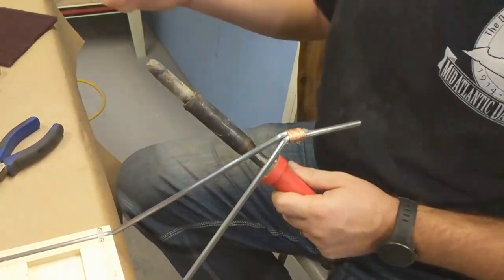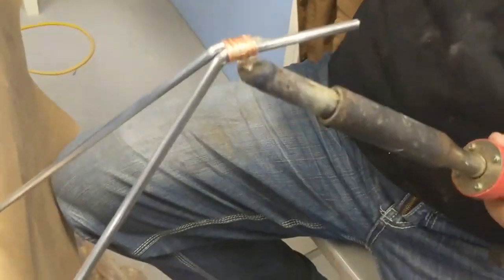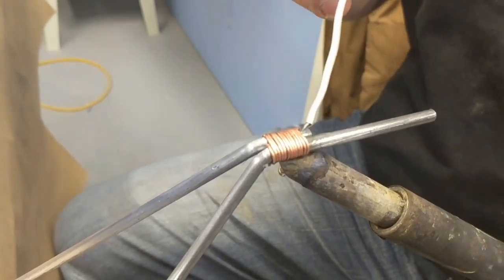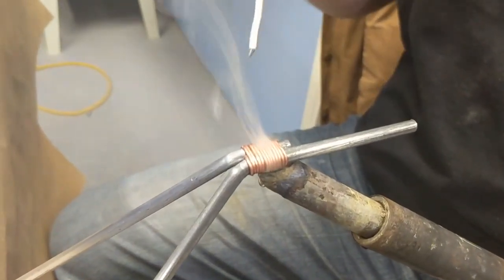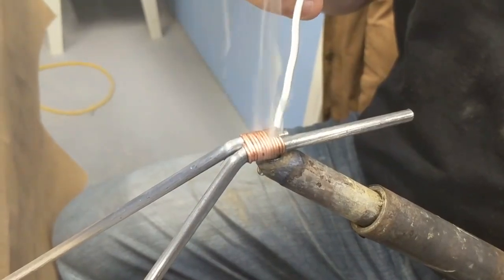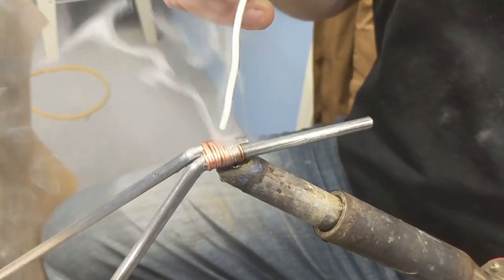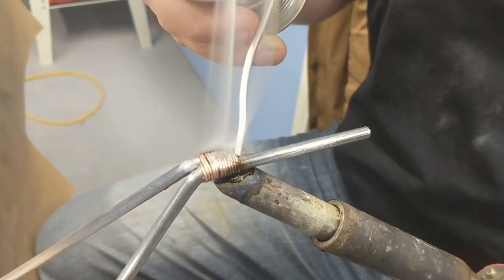Then take your soldering iron, put a little solder on there, get her started, and then just push up to it. You'll see the flux starts to melt. Let it sit on there for a little bit. You want to touch on the top — you don't want to use the tip to melt it. You want to wait until the wire gets warm enough to melt it itself. Make sure you do this in a good ventilated area because there will be a lot of fumes. Now you can see it's starting to melt. Now you understand why you need to have such a big iron. It's starting to soak in there, so I'll slowly work it in. It's going to drip on you, so make sure you don't have your leg underneath it.